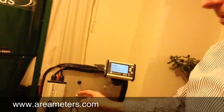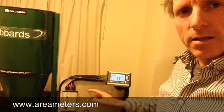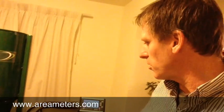Calibration complete. Now we'll start drilling. So we've calibrated the machine, and what we're going to do now is start drilling. It's simply turning on the speed switch here, and this is our run/hold switch. When the drill's down, it's drilling; when it's up, it's not drilling. That switch can be mounted on the drill itself for automatic run/hold, or otherwise in the cab for a drilling/not-drilling operation. Real simple, no drama there.